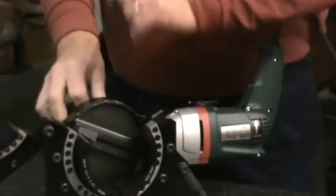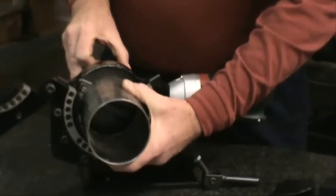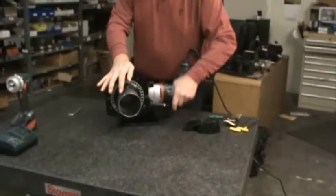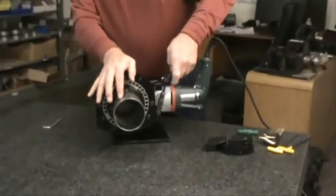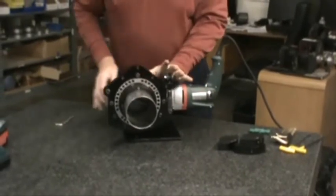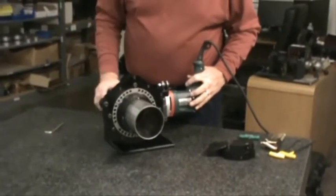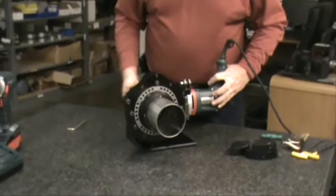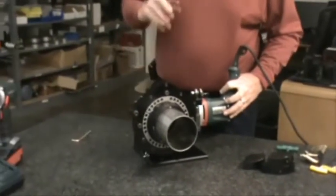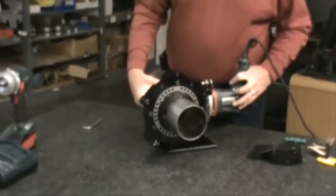You have now locked it down. We will put in our piece of tubing. Come down, clamp it. Put on our adjustment screw and lock it down. Now you'll feed the cutter head into the piece. You know you've done a full cut when you're taking a chip all the way around the material.